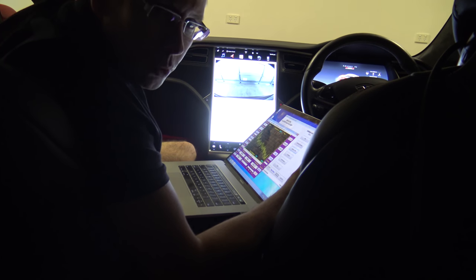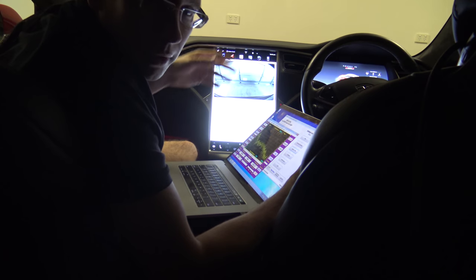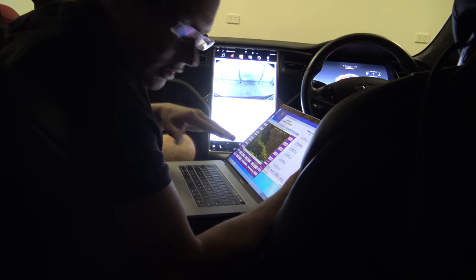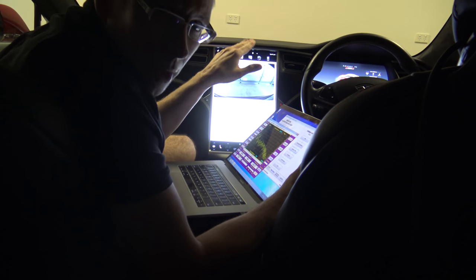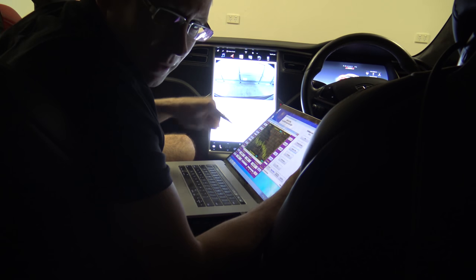At the moment I'm doing the front left speaker. I've turned the sub down as low as it can be, but it's on in the boot rumbling away — though it shouldn't matter too much. I'm going to make these high-pass filters so these speakers aren't going to try and do too much bass, and you'll see a difference in the spectral display.